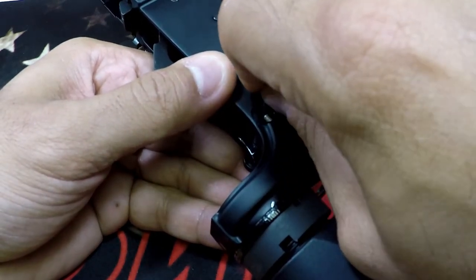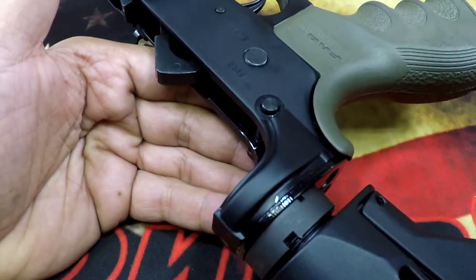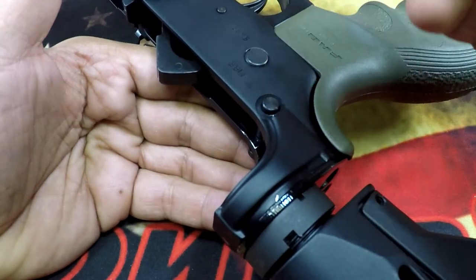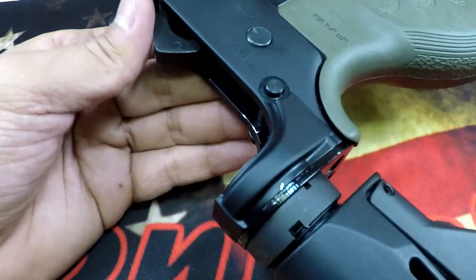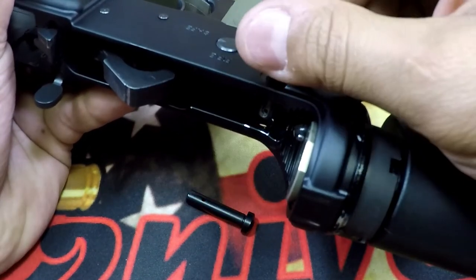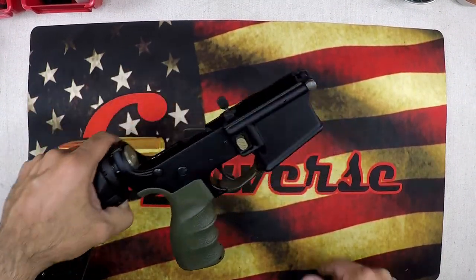Put the old pin in through the bottom, push it up, and then use the Allen wrench to push the detent back into place while pushing that old pin up to act as a slave pin. We just did it in one swoop. Mistakes will happen and you'll mess up at least once, but the good thing is you don't ever have to worry about losing your detent because it's pretty hard for it to fly out. Get your old pin with the channel facing forward, push it down and rotate — there's our channel — and you'll hear a click. Replaced. That easy.